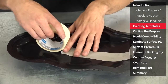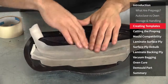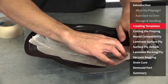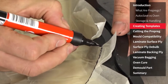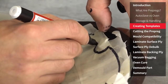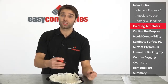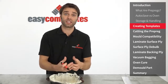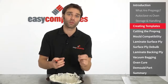We're doing this because we want to know the accurate shape of the various pieces of material that we're going to laminate into the mould. We're just going to use a very simple method of masking tape over the surface and mark the various joins and shapes that we have. There are many ways to create templates from a trial and error approach using cut pieces of paper to CAD flattening methods. In all cases the important part is choosing where to put the cut lines. The reason why I'm putting cuts down in the negative features in the corners is it actually makes the laminating procedure that much easier and reduces the chances of bridging, so you're less likely to get voids on the corner of your part.